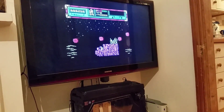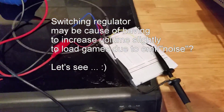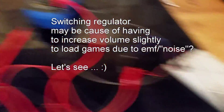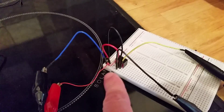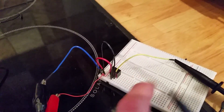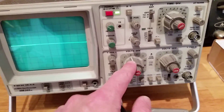Wondering why it's taking more volume to load - it's up on a test rig with a 9 volt variable power supply. Put 9 volts in, the red board into the same switching regulator relay, which is what I suspect is causing the slight need to increase volume. Ground in the middle, out is the yellow one - it's up on the scope. Out and ground - let's go 10 times attenuation probe, so anything on this you have to multiply by 10 in your head.